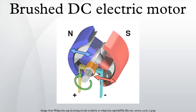Ward-Leonard. One interesting method of speed control of a DC motor is the Ward-Leonard control. It is a method of controlling a DC motor and was developed as a method of providing a speed-controlled motor from an AC supply, though it is not without its advantages in DC schemes. The AC supply is used to drive an AC motor, usually an induction motor, that drives a DC generator or dynamo. The DC output from the armature is directly connected to the armature of the DC motor.